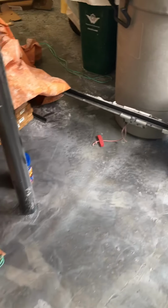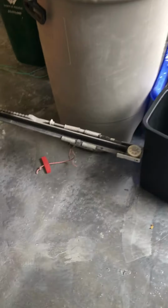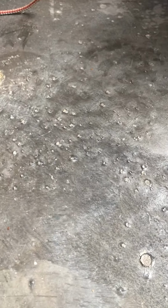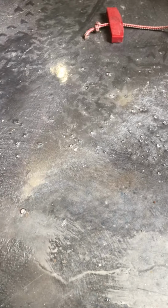And according to tech support at Rock Solid, that's the problem you run into when the temperature increases. It's not just high humidity and heat. If your temperature is rapidly increasing, your concrete is going to exhale. You don't want these bubbles. I thought maybe they'll disappear as it cures.